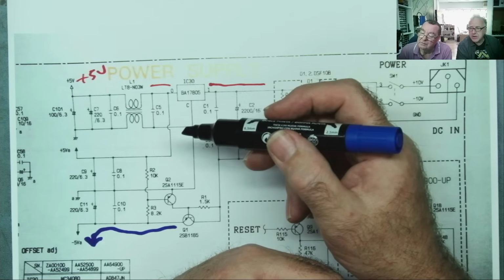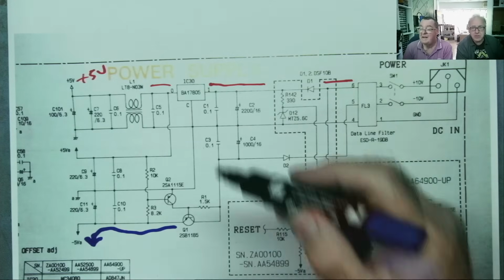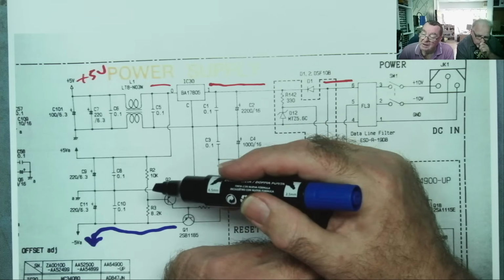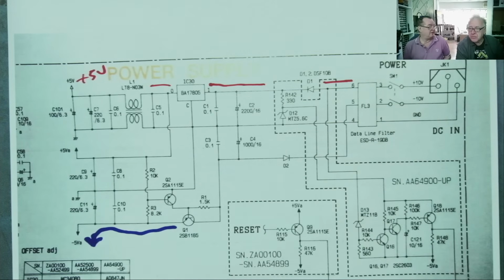The resistive divider gives you a voltage on there, but personally, I would use a 7905. Also, you notice this voltage divider, one end of it actually goes to the output, which is the output from this transistor. Interesting.